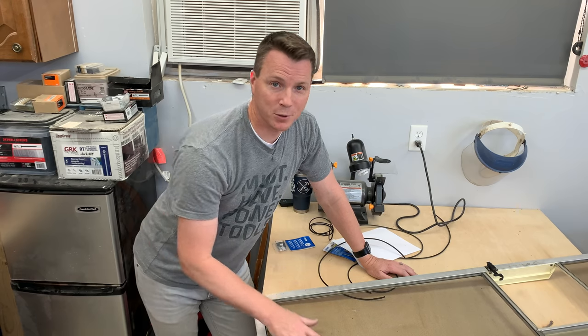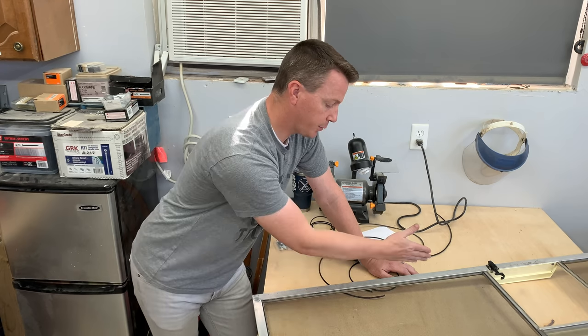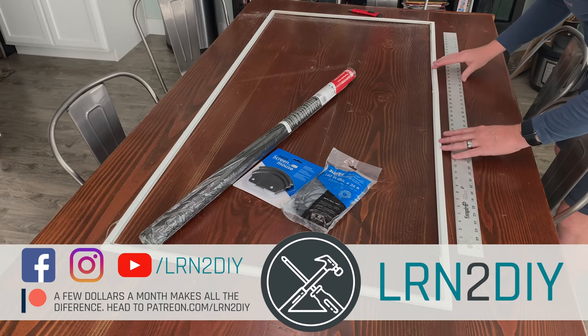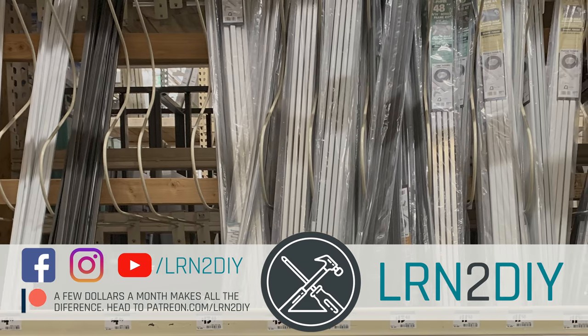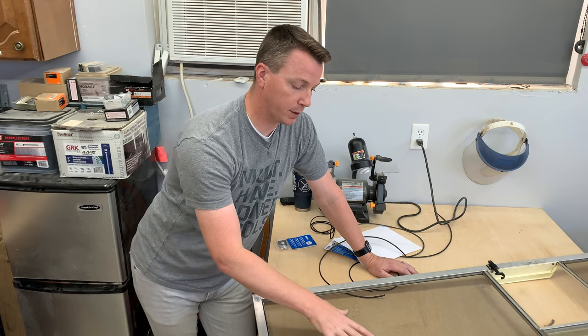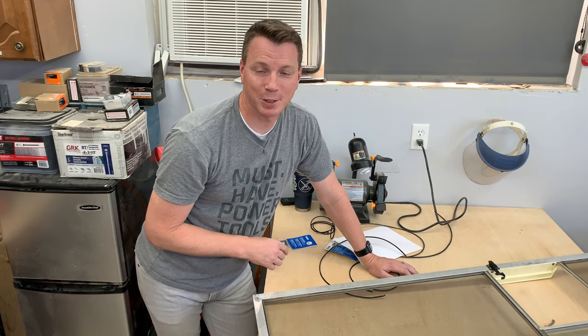And with that, the new screen is in place — nice and taut and everything looks good. Now if there's more to it in your case, for example if you have a bent frame, you can actually bend that back into place using a straight edge, pulling it up against it and then replacing the screen. Oftentimes it's that tension where the screen got pushed, and if you can straighten out the frame you're in good shape. Or you can buy a whole new screen, or custom cut one yourself with a kit — all you need is a hacksaw and the same tools you see us using here. The kit comes with everything except the screen material, which you'd need to purchase separately. And that's it for this project — thanks so much for watching and we'll see you next time.